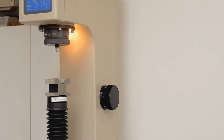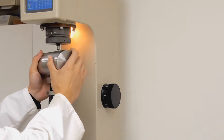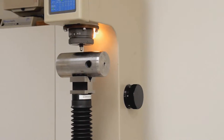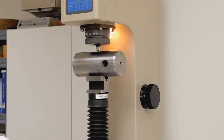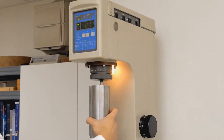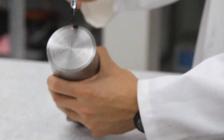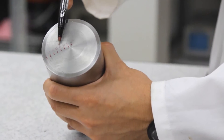In our shop, the pin was cut in half to expose the inner metal material. Then, using a Rockwell hardness tester, the pin undergoes an outside surface hardness test. We also test the pin's inner core and mid core by testing the sample at several locations from the center outwards.